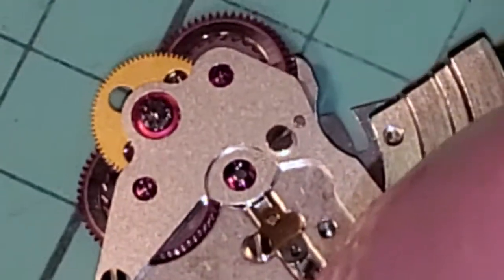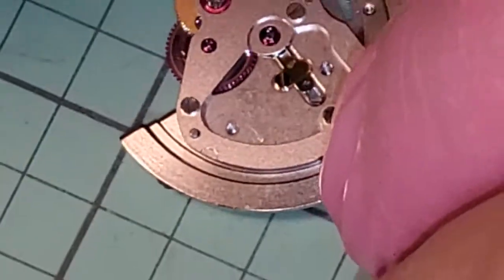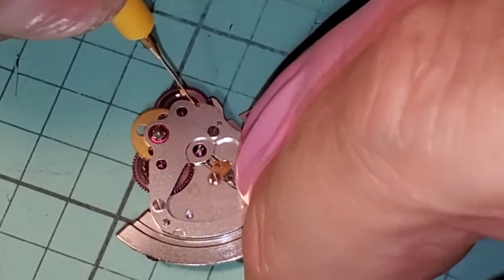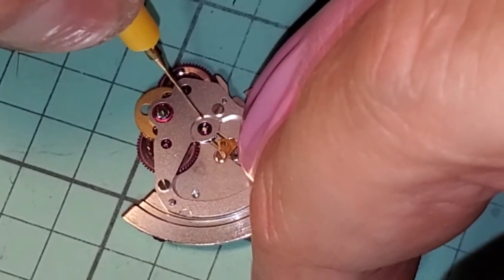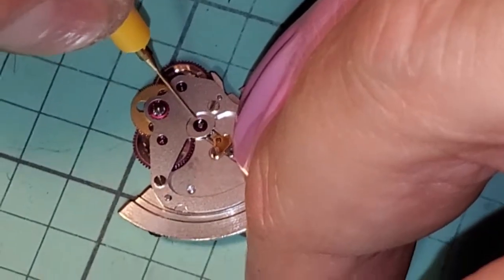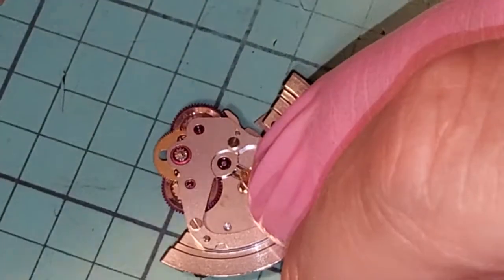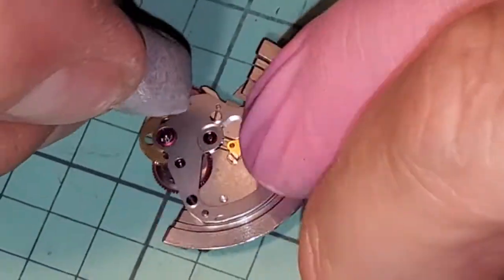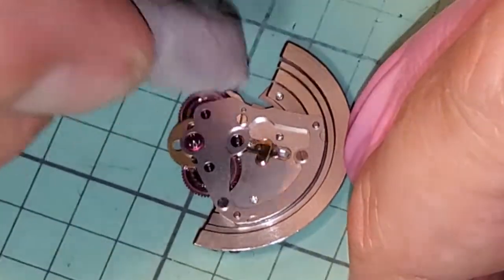You'll see the perception change of the reflections at the pivot in the jewel. Yeah, neat — you can actually see it sort of drawing it in. When I pull my oiler away and there's no oil on my oiler, it's pretty much guaranteed that it's gone there. It's almost like the shape of the reflections and the colors change slightly as the oil's gone onto it. Now we're going to oil the top of the axle too because it has a jewel, and these jewels do crack. I saw the oil draw, and I am going to clean the oil off the tip of the pivot.